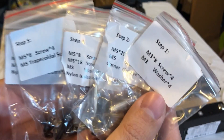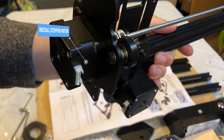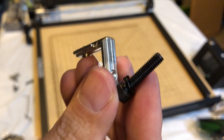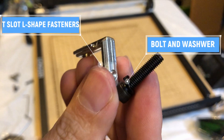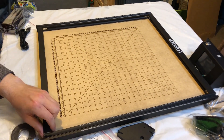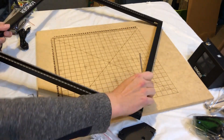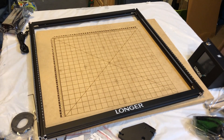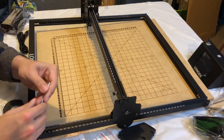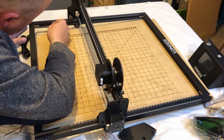What's nice is that these bags are labeled with steps 1 through 6. The first step is that you're going to attach your stepper motor to the X axis along with the synchronization shaft. Now we're going to use the T-slot frame fasteners and bolts to secure the frame together. We're going to insert the bolts on the sides and tighten them gradually to make sure the whole frame is squared. Once we have the frame squared, we're going to put the X gantry on and tighten the inside where these grub screws are — this will help ensure the frame doesn't move or anything backs out.